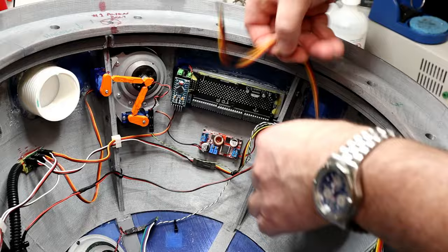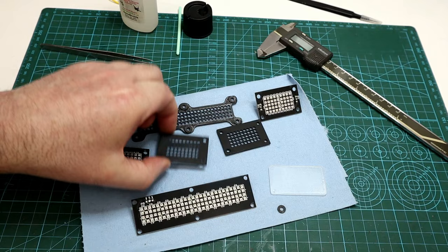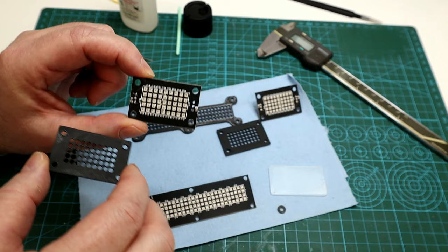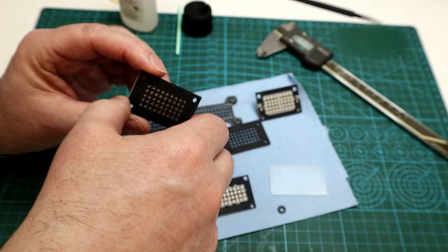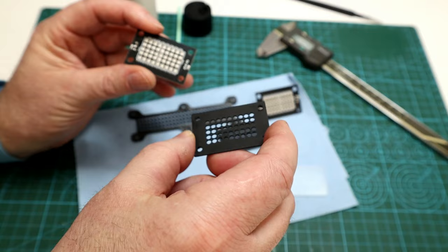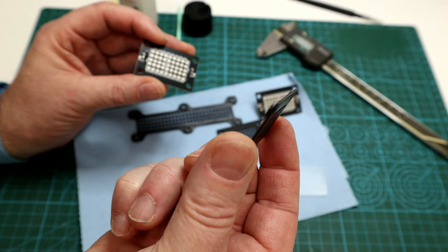To bezel or not to bezel? That is the question we're dealing with now. I think with these AstroPixels you pretty much have to put a bezel over top of them. The white NeoPixel Nanos just distract too much, and in my opinion it looks a whole lot better once you place a bezel over top of them. I just 3D printed my bezels — these files were on Darren's AstroPixel page, link will be in the description, but they're the same as the Badly ones as well if you've already printed some of those.